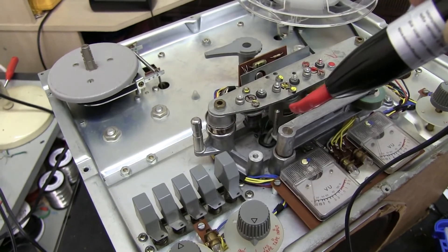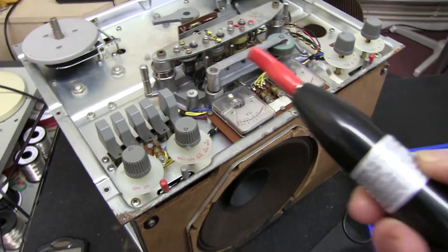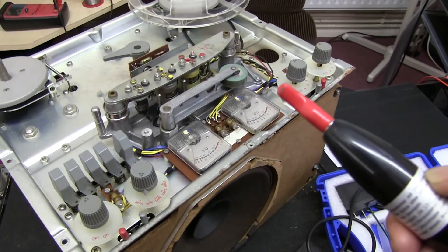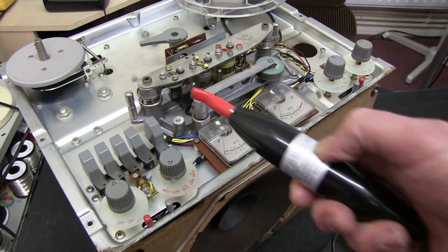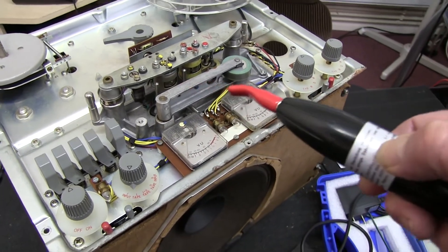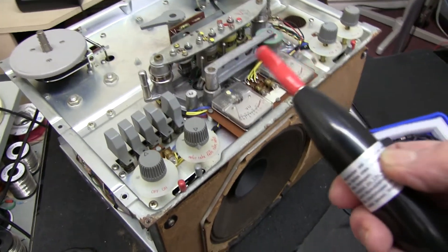The aluminium parts — you won't feel any buzzing. These are aluminium. And basically that's it. You just move it away. All this stuff about creeping slowly forward and creeping slowly back is a load of rubbish. This thing is oscillating at 50 hertz — you'd have to move it really, really fast to leave a north or a south on anything where it was touching. 50 times a second, moving at a normal speed, the field is fluctuating so fast. You don't have to creep forward and creep back for metres — this has no effect after a few millimetres. People talk about walking away from something, but anyway, it's pretty straightforward.